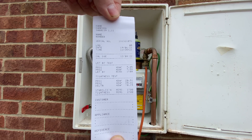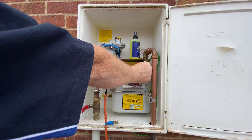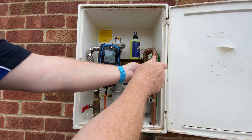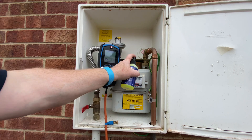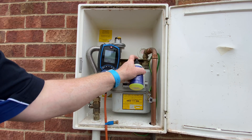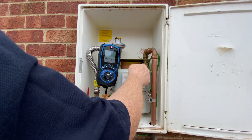The printout also has the date and time on it. Afterwards we take the test nipple off, take the new gas tube off — and it's very important we test that test nipple. Just tighten it in, don't tighten it too tight, just nip it up. Very important: once we've turned the gas back on we need to make sure we actually turn the gas back on — I've had an apprentice spray the test nipple but not turn the gas back on. Then we spray the test nipple to make sure it's all okay, because the rubber underneath can split if people tighten them too tight.